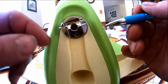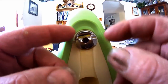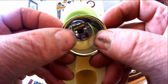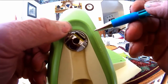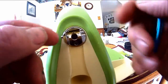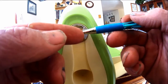The handle broke off, so I took it out and put a metal collar over the top, making it conform to the diameter. I drilled a new hole through it — you can see the drift pin right here — then drilled through and put two drift pins in. The collar was held with the drift pins, and then I came off the lathe, drilled two more holes, and put the handle on.